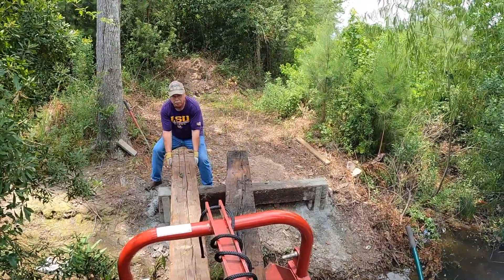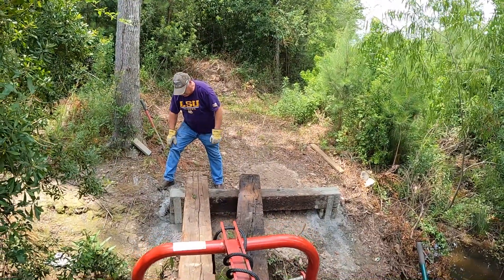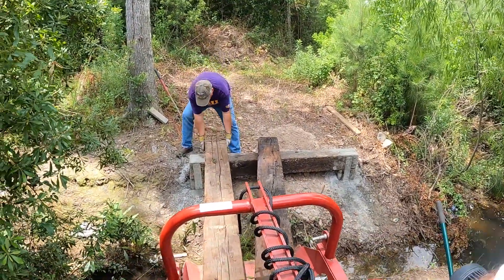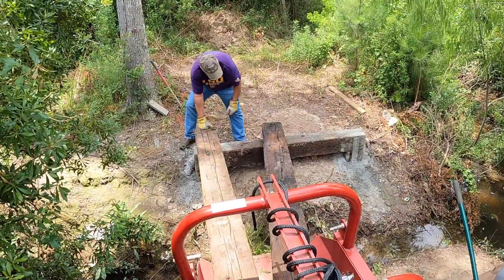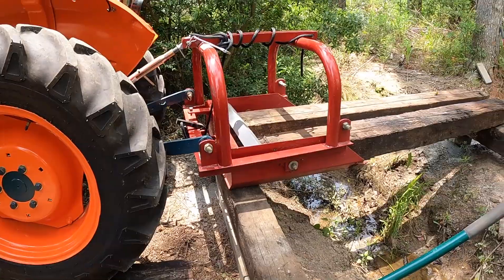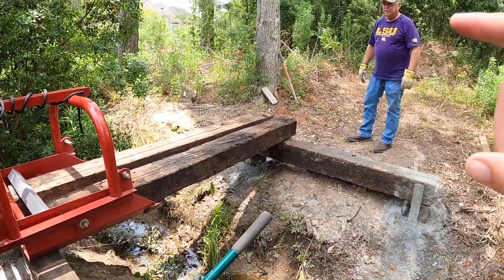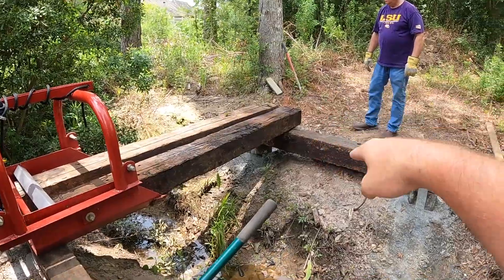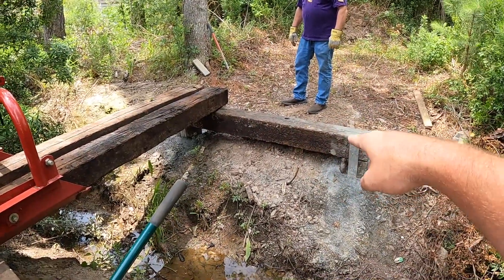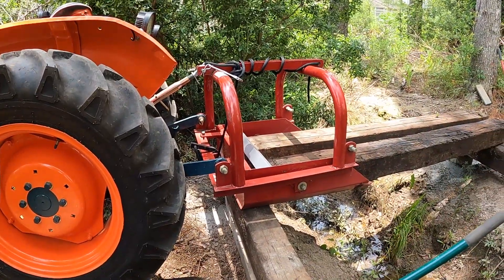Watch your fingers coming down. Leave it right there. Alright, so the plan is working — use the timber to level off the tractor. When ready to crawl, set the bucket down, then we're going to attach lags down in this beam right here, and then I'll tilt my bucket a little more, pull the tractor away. It's gonna work out pretty good.